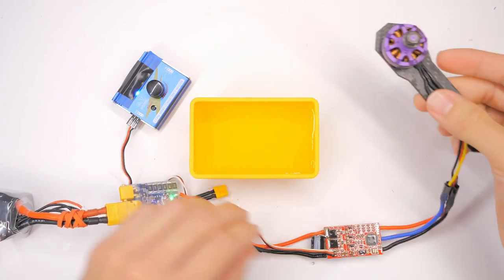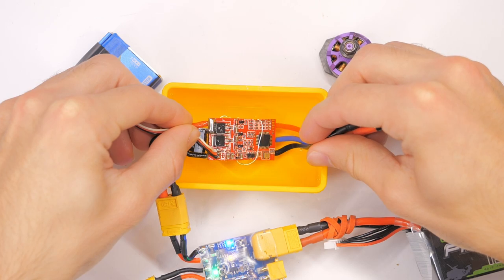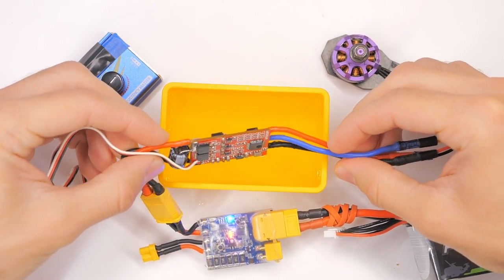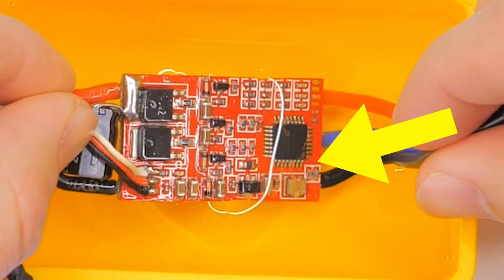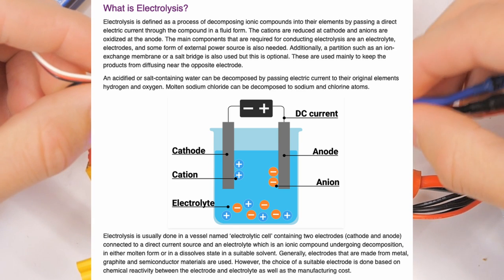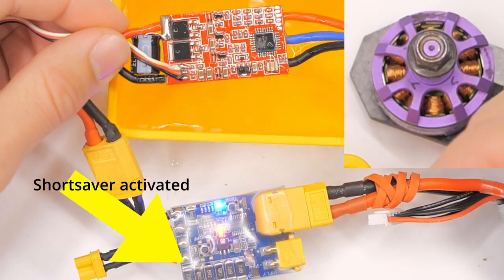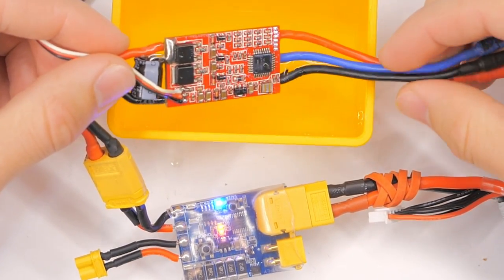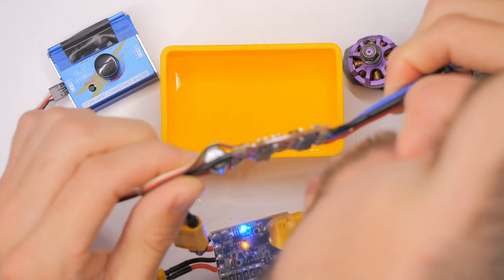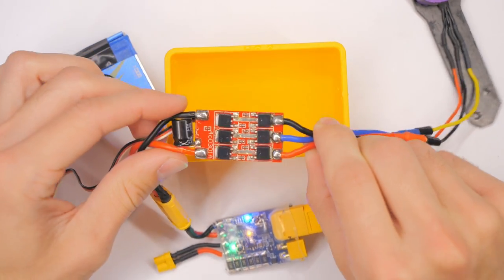Our motor is spinning and working, so let's test this out first without the motor on. When I dunked the side of the ESC with the motor wires into the salt water, I could see bubbles coming from some of the soldered components — this indicates that electrolysis was occurring, meaning there was a connection between those components through the salt water. When I removed the ESC from the water, the motor twitched and the short saver shut off the electricity, meaning a short circuit situation was occurring in the ESC. That was a failure. Once I cleaned off the salt water and restarted it, it was able to function again, but it's not good enough.